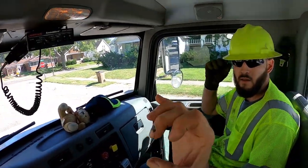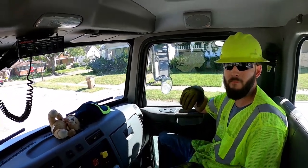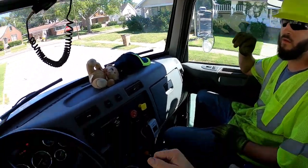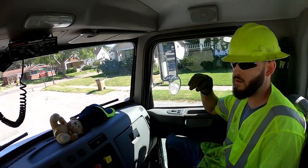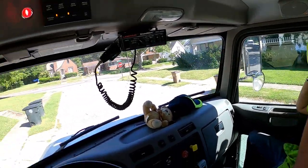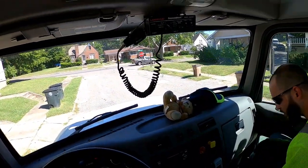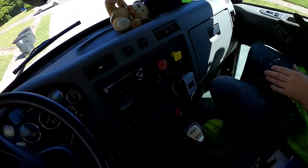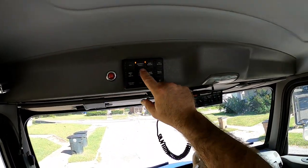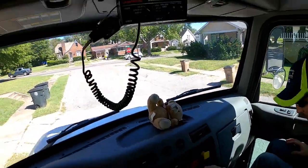You notice that little black plug-in on the back by the chain? That's what sends the signal. You could take that plug out and put a regular semi-trailer seven-way cord in. That is a little radio frequency transmitter, and it transmits the signals back to that light bar. And the light bar has the receiver. That's pretty cool. All right. We got to Cummins? Yep, Cummins in Sykeston. And away we go.